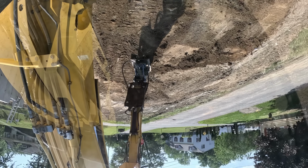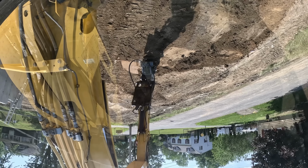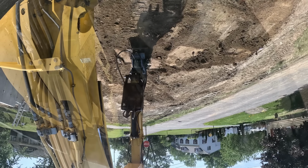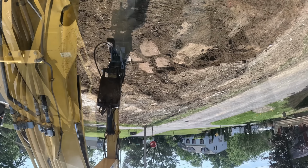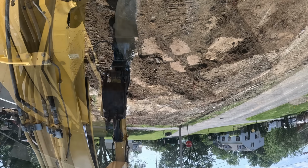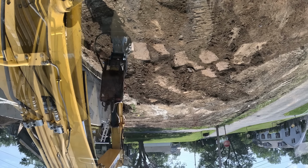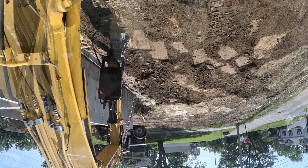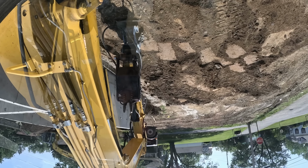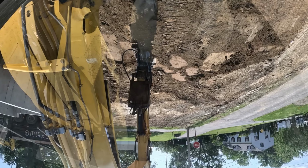All right, we got the vibrator on. We've already come up one lift. Backfill, another lift. Got my gravel being delivered. Dropping the second load off of the day. There's gonna be a lot of material around here. We've got to strategically place it with these power lines, get them under where we can. But this right here allows them to back over this without getting stuck if we get more rain, which we've had a ton of rain, man.